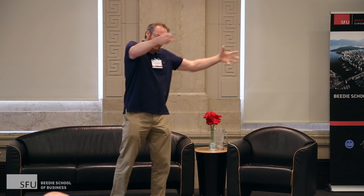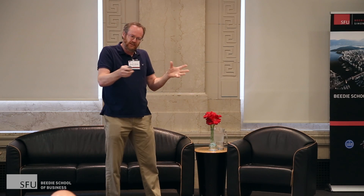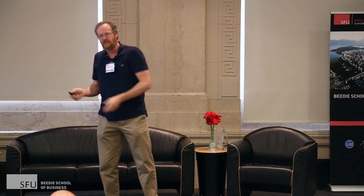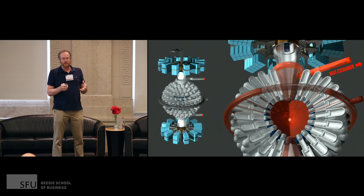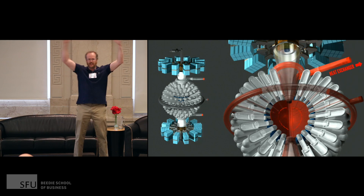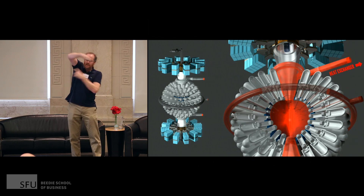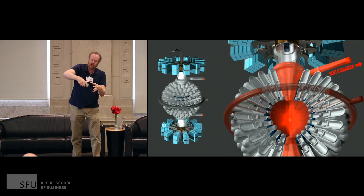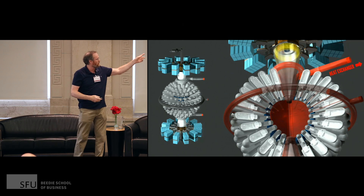The way I want to do fusion is a bit different. There's the tokamak with a constant magnetic field, and there's laser fusion with no magnetic field. My big idea is to mix those two things together. It's going to be a big tank of liquid metal that spins around in a circle and opens a hole in the center. I shove some hot gas — called a plasma — into the center, which is the yellow thing you see here.